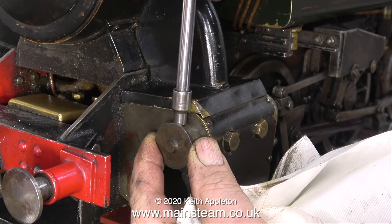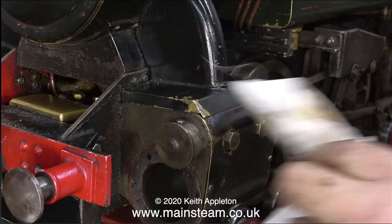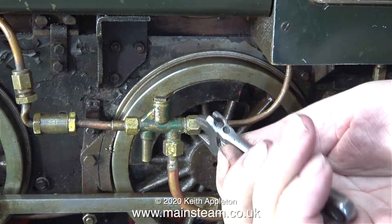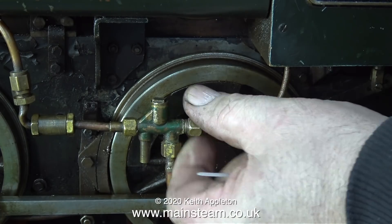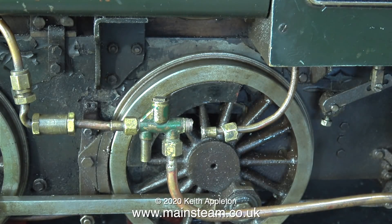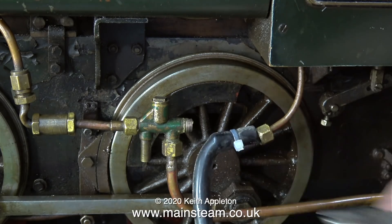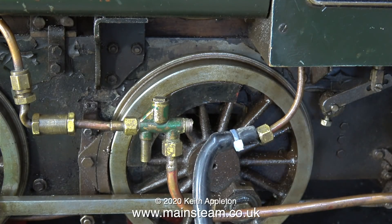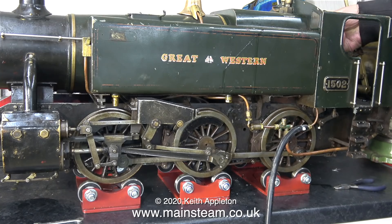I really love steam locomotives — they were my first love going way way back — but I have to admit they are dirty, mucky, filthy things. As previously shown, I'm connecting an air supply via the injector steam pipe using a piece of silicone rubber tubing and a tie wrap. I haven't replaced the front cylinder cover yet because I'm hoping that the first blast of air blows away at least some of the debris in the cylinder.